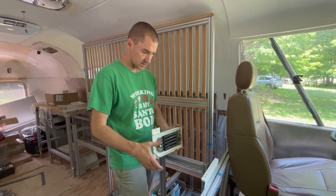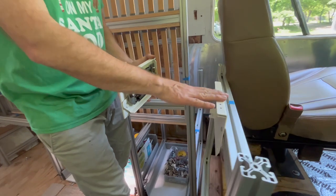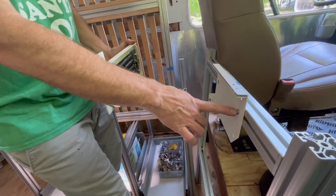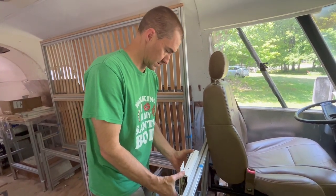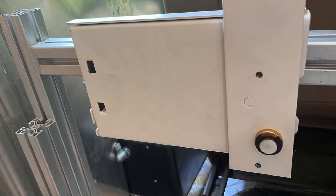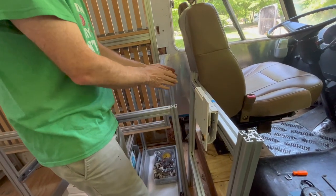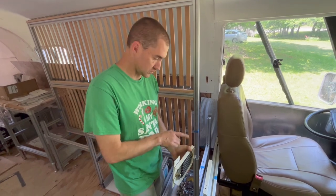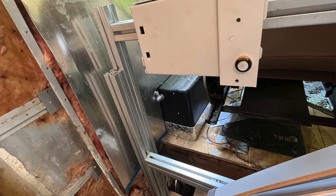This is the first test of mounting the hinge onto the 80-20 frame. This piece is now mounted with two screws. The only modification I had to make was to drill these holes slightly larger. This goes together like this, and this is the plane that the bed frame mounts in. I've determined I need to move the whole hinge back slightly, and I can move it into place to see if I can try. I'm just going to make a couple of adjustments here and move it into place and see what we've learned by this test.